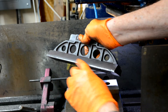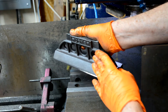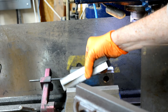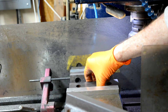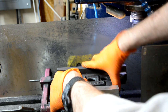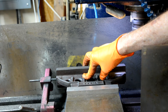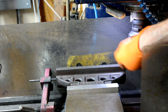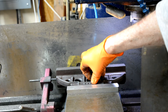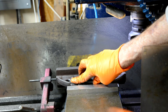This edge — I have no idea where that's at, and I've been machining things to this face. What I've done is installed a couple of parallels in here. I'm going to set this on there and then tighten it. This edge does not have to be parallel to anything really, because you don't use it like that, but I'm going to try and get it somewhat square.